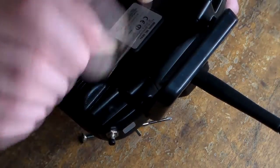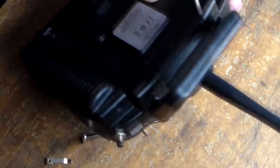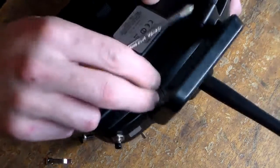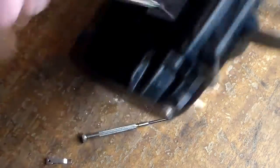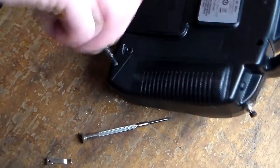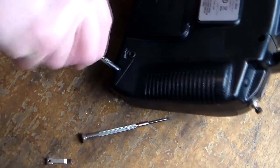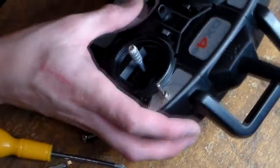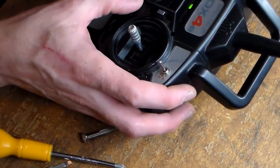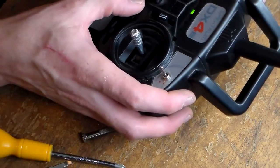I have actually left this piece of metal out. What I did yesterday was to get some insulation tape and just tape it to the inside of the controller, so that if I wanted to put it back to how it was it was always in the controller and I didn't lose it — but I forgot to do that today. Just tighten these down, but don't over-tighten them because you'll snap the plastic pins — just when they start gripping, stop. And there we go: a nice smooth, non-clicking throttle stick that you can actually position anywhere without it clicking back, so you can get a nice steady hover.